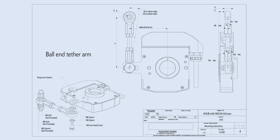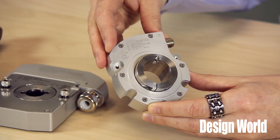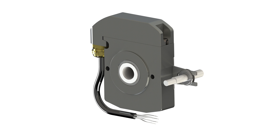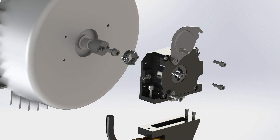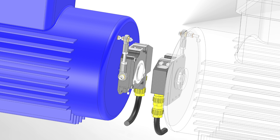The aim is solid feedback no matter the application. In addition to all the features that ensure durability in tough applications, there are also a series of mechanical configurations including versions with a solid shaft, through shaft, blind shaft, or integrated coupling to fit an array of applications. The through-shaft encoder version allows for redundant mounting; setups with pin mounting prevent rotation. Encoders with integrated couplings work through hollow shafts to 20 millimeters. A final option uses a coupling and a solid shaft for a low profile. All the encoders have a low profile that simplifies installation in space-restricted places.